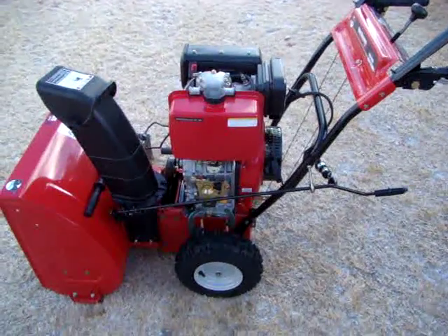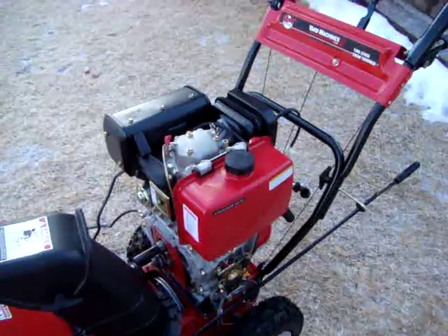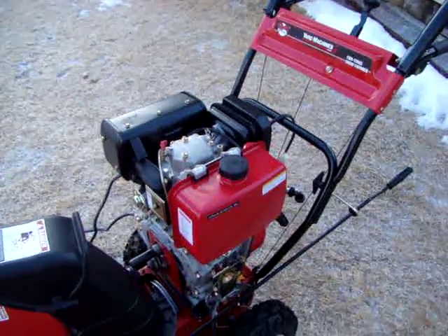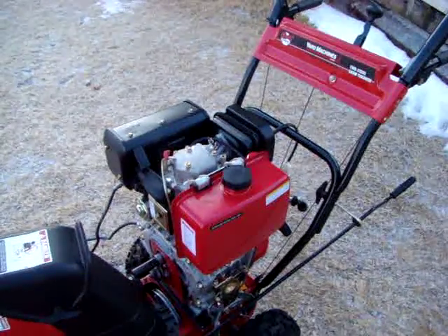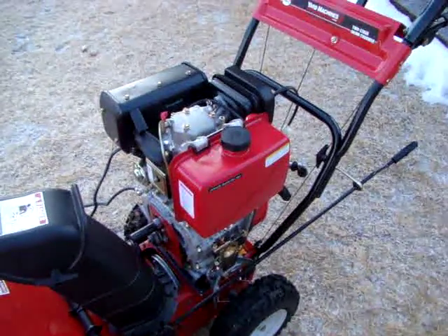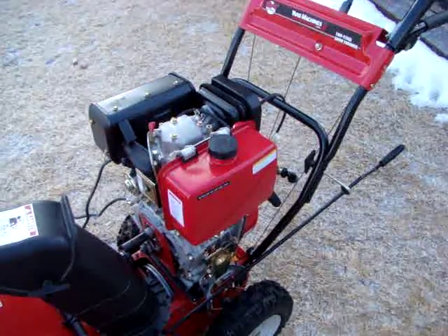Anyway, I'll start it up one more time and run it up a little bit. It seems like it has a little miss at high RPM — I'm not sure. The engine's brand new; I've only run it for probably 10 minutes up until now, so it probably has a little bit of breaking in yet to do. The manual says like 20 hours running under minimal load and low RPMs to break it in. I don't know if I'm gonna wait 20 hours — this whole machine hasn't seen 20 hours in five years. I'll probably just run it when I need it and see what happens. If I wear it out sooner, I guess that's the chance I'll take.